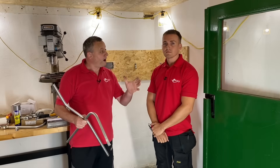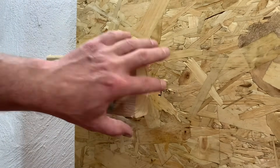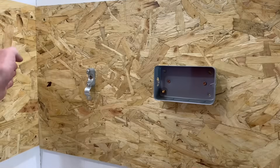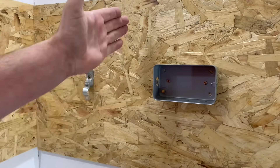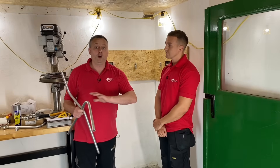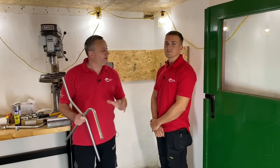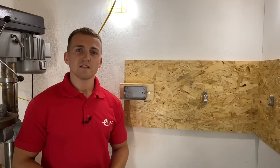That's quite a hard skill to get to an exact measurement, so we've mimicked it here. We've got a socket box some distance off the wall, so that will be a big double set. We come to a fixed point where we'll have to have a 90 degree bend, and then we'll cut back to the required length, thread, and put a coupler on to finish off that conduit.